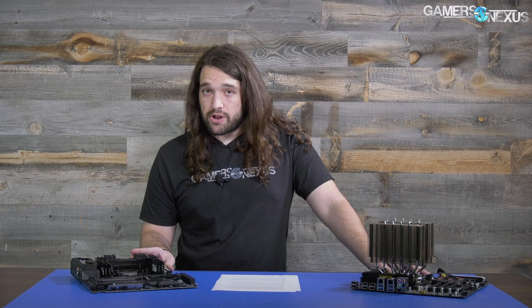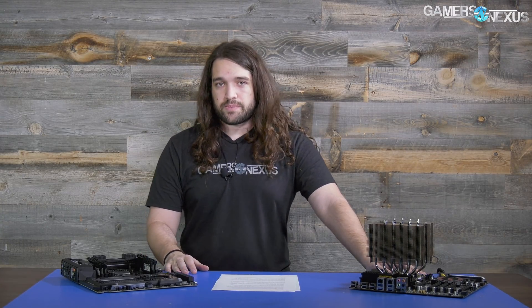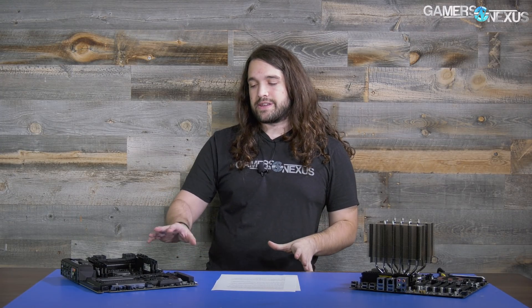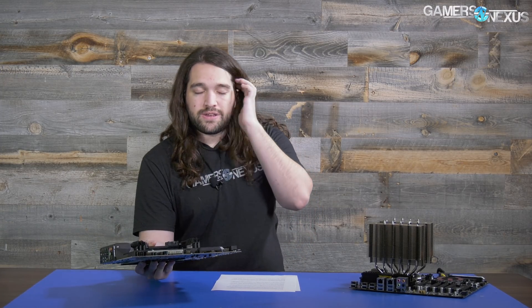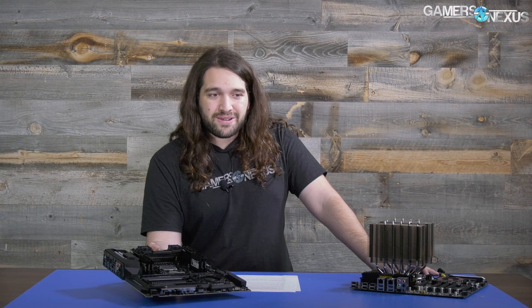Buildzoid is analyzing this board for us and will have a separate video with full PCB and VRM analysis on this channel. We're also going to be doing some quick memory tests to see if EVGA has fixed their longstanding problem of poor memory clock performance on their motherboards — if they have, that's a big deal. The X299 Dark has every bit of hardware it needs to approach and achieve better memory clocks; we just need to see if it actually does. As far as the cooling, the heatsink is well designed, and it's sad that we have to explicitly call that out, but it deserves it.